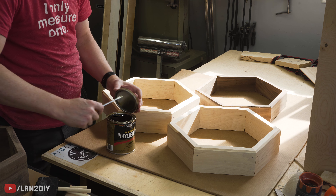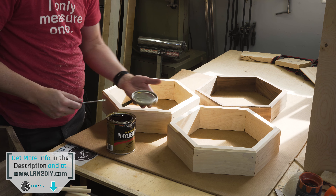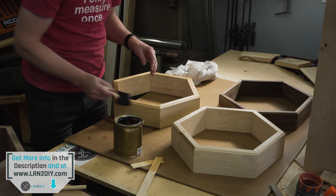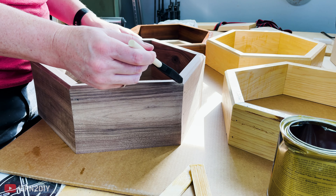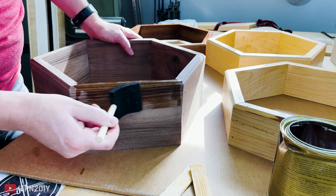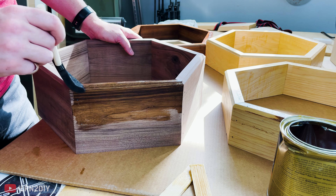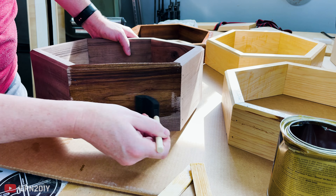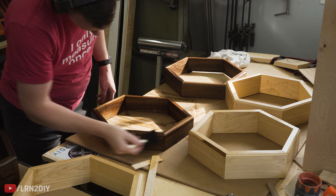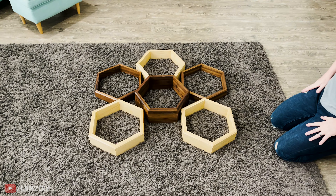For finish, I'm using some Minwax Fast-Drying Polyurethane — a clear satin. I'll put links to this and any other products in the description below. I'm putting a fairly heavy coat on each piece. I love the look of putting that first coat on a piece of walnut — it really helps the grain pop, adds contrast, and gives it a nice shine. Per the instructions, you'd let it sit for three to four hours, sand with 220 grit, then apply additional coats drying 24 to 48 hours each. What I ended up doing is just doing one thick coat and leaving it at that.